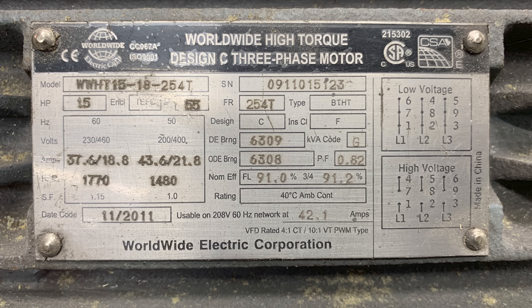I want to be the first to admit there are a whole bunch of other topics that need to be covered when it comes to selecting a motor. For example: what kind of duty cycle do you need — is this thing running 24 hours a day or five minutes at a time? What's the environment like — super hot, super cold, or will your motor be underwater? Do you need speed control? Does your motor need to be mobile and powered by a battery, requiring special controls or a DC motor? And what about all those other numbers on the motor's label, like service factor? Fortunately, I've covered a lot of these in previous videos, so I'll put links in the description so you can fill in those details. Thanks for watching.